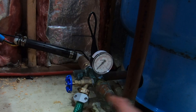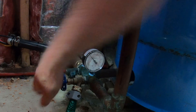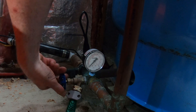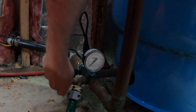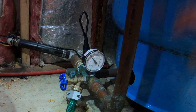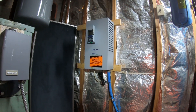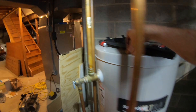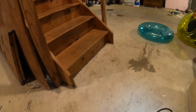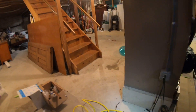So now the tank is completely empty. We're going to close this up. Now the tank is empty. What I'm going to do is set the pressure inside the tank to 70 percent of what I want to set this at. This is now going to be 65 PSI, so 70 percent of 65 is 45–46 PSI. We're going to take this valve cap off and use our air gauge to set it to 46 PSI.